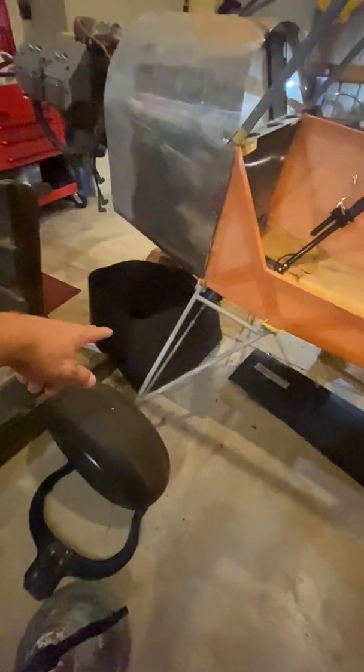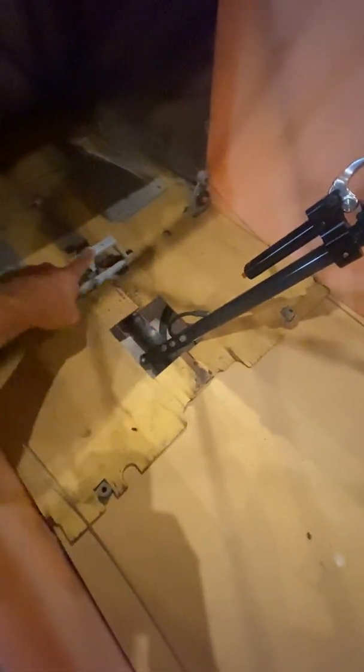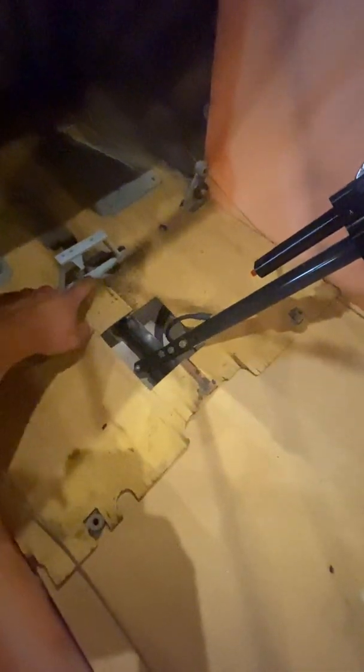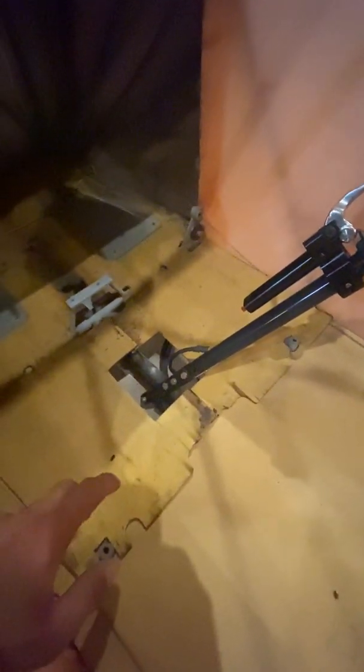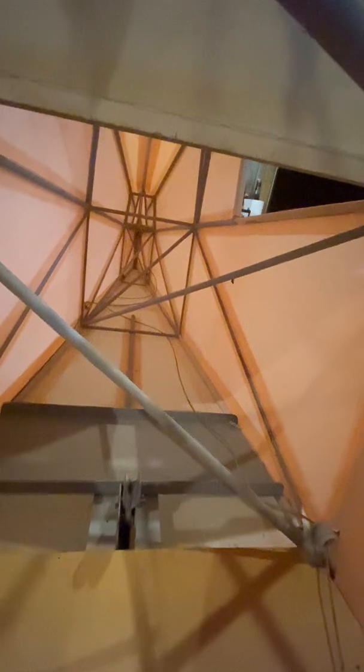I am going to be doing a carbon fiber boot cowl. That's the reason why this looks the way it does. I'm using that to wrap it. If any of you own these airplanes or have owned them, you know that the stock control sits on 2 pillow blocks here. I have actually cut the aft pillow block off, made my own mounts underneath here, and got rid of the elevator cable control system and went with a push rod system with a bell crank here, and then the rod will poke out the tail there.